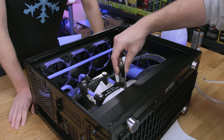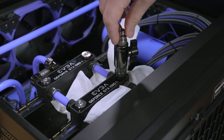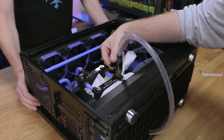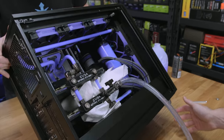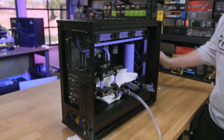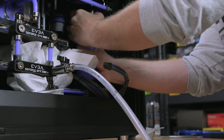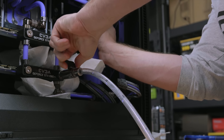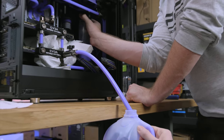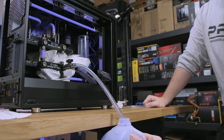So now what we do is we just thread in my drain. It's adding a couple extra steps to drain this system — I think Josh agrees that this was a cleaner way of doing it. Now we can set it upright. As long as this is perpendicular, it's blocking the flow — that's the easiest way to remember the valve, whether open or closed. Perpendicular means closed — it's like a roadblock across the road. I've got to undo this cap so that we can let air in. Oh my God, it's leaking. That's a feature too. Completely drained.